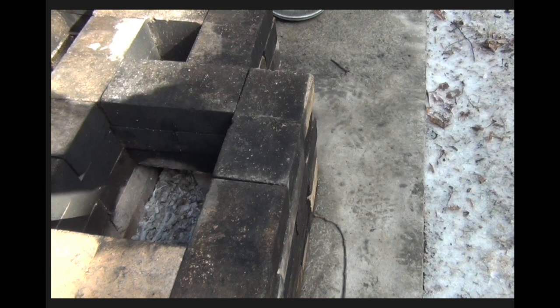And oh, the riser - you have to have these little Vs, these little angles at the riser. No, you don't. You have to create a vortex, it has to swirl around. No, it doesn't. You can stack bricks literally in four minutes and make this - and it just works. If there's no smoke, it works fine. What else do they do in the batch box configuration? People will even come to this channel and say, 'Matt, it's a one-to-two-to-four ratio,' or whatever - you don't need those ratios. Come on, man. All you've got to do is stack bricks like this.